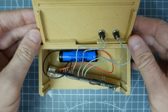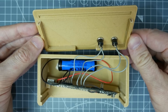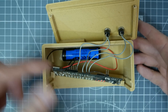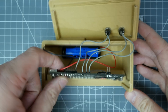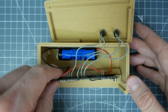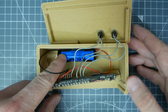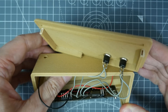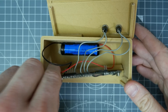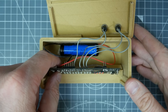Inside, we've got this 3D printed case. It has a lip around the lid — that's glued on because it was a bit of an afterthought. I realized I probably want to take this apart, so I want it to be press fit. We've got a little stand for the PCB to push into. And then we've got a lithium ion 3.7 volt battery in here as well. That's keeping the DS3231 in check, so it makes sure it keeps the time.